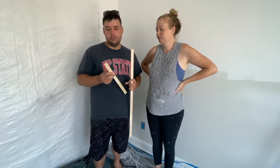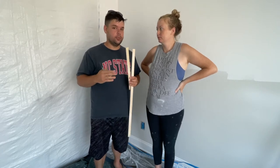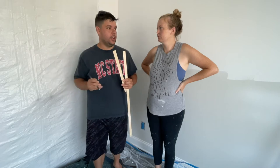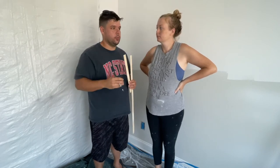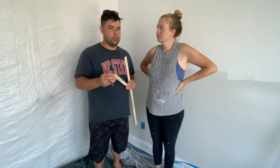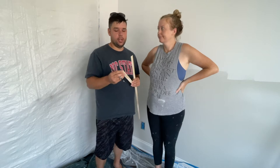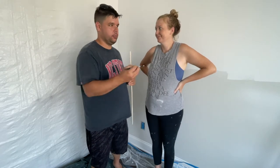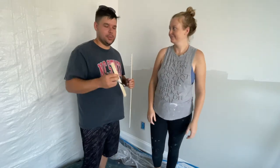But mainly all you're dealing with is 45s, because you want to make a 90 degree angle for corners like this. And then whenever you have a piece that's not long enough across the center of a wall, you're still making both a 45, because they're going to meet up together and slide into each other. The angle is just the same way when you're going the same on the wall. So you'll see as we put these together.